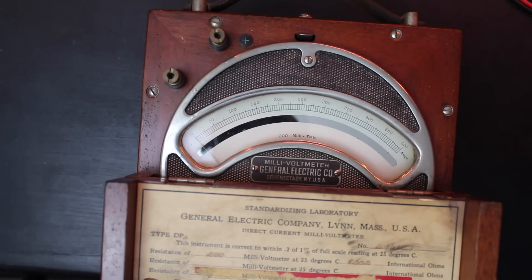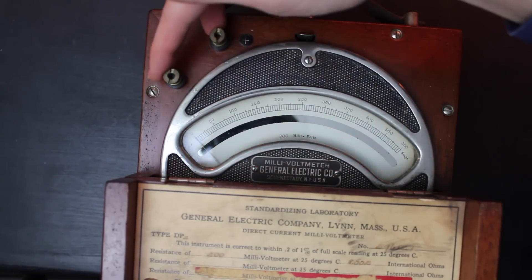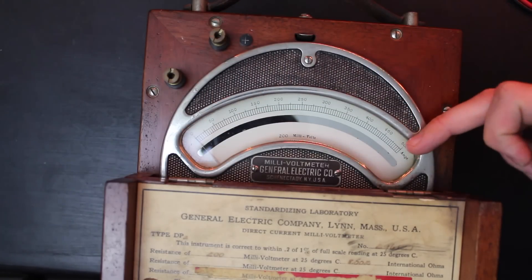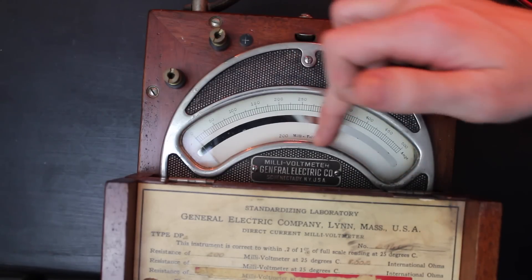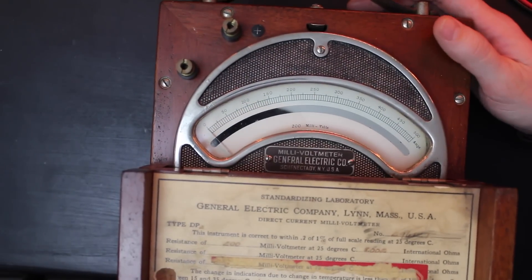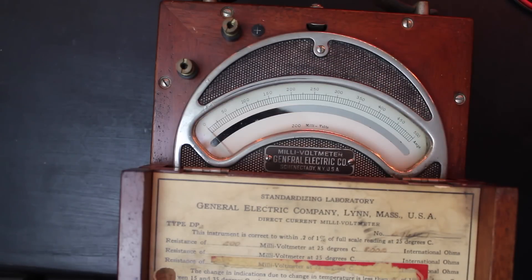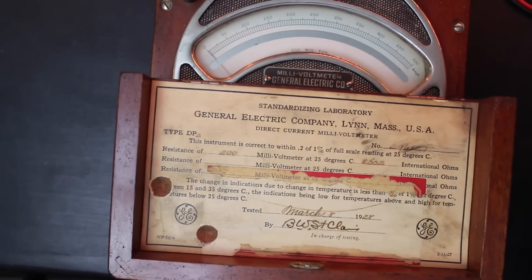There are no batteries or anything for this meter — it's completely passive. It's a standard DC panel meter, analog obviously. Our input terminals are right here, positive and negative, and it's showing 0 to 500 amps, but the full-scale voltage is 200 millivolts, marked down on the front. So obviously some kind of front-end circuitry is needed to scale that down so it reads 500 amps.